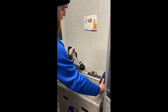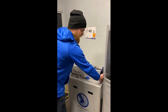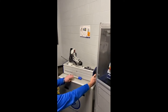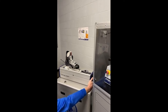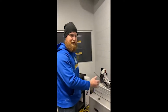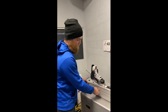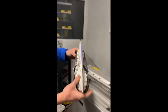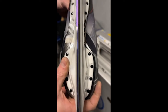The skate was being sharpened this way — now I'm going to flip the skate around, secure it in place, and only run a half pass, so I'm going to press the sharpening button once. When it gets somewhere near the clamp steel, press the sharpening button again to return it back home, and then we'll check. Typically when you're hearing different noises on the half cycle, you can hear the sound changing — sounding less smooth typically represents that the wheel is not perfectly aligned yet.